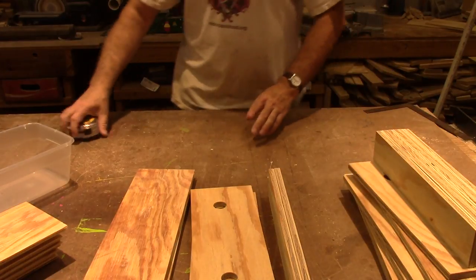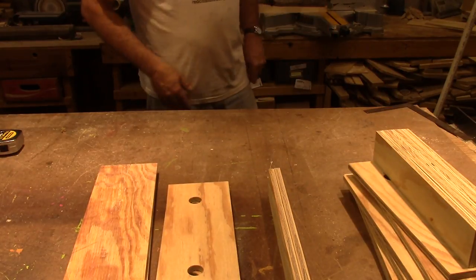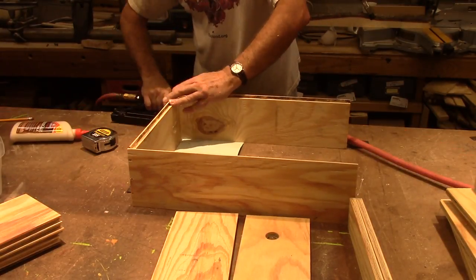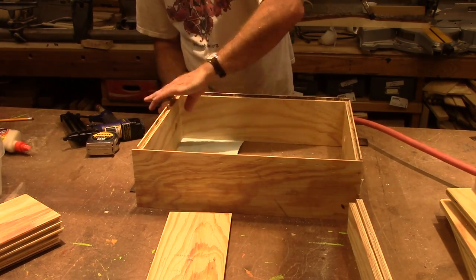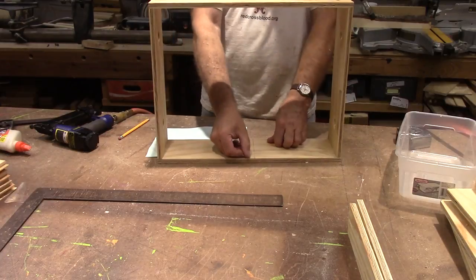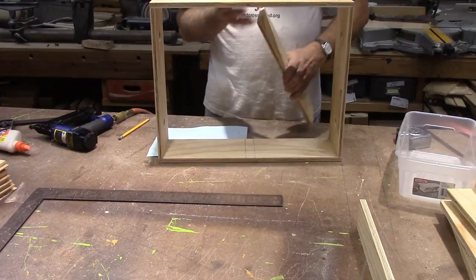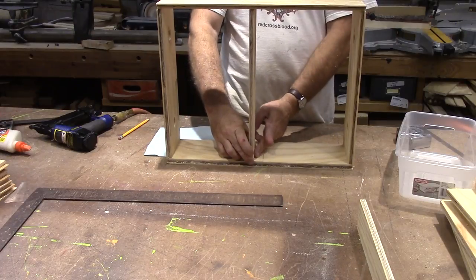You will need two of those. I've cut a dado down through the bottom. I've marked the center line and then came off one half inch on both sides of the center, and that gives me a one-inch gap. I'm going to install these on the side with the dado, just above the dado on each side of that line, so I'll wind up with a one-inch gap in between.